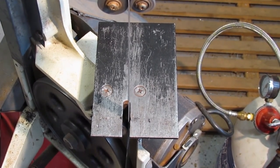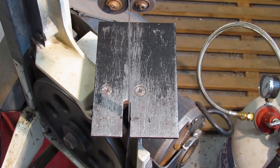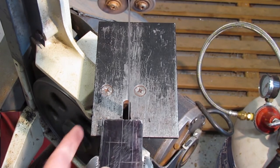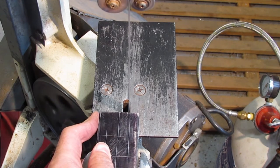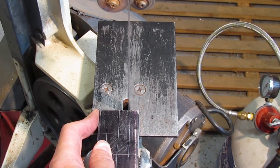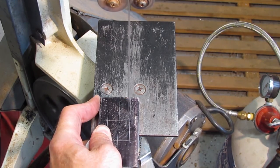The bandsaw I have has a plate mounted to use the saw vertically. This comes in handy for cutting odd parts. I squirted a little WD-40 as a lube for the blade, using a pair of locking pliers to hold the blocks and slowly feeding them into the blade. First few seconds are actual cutting speed and then the video is sped up.